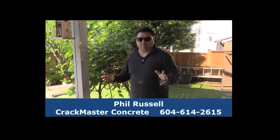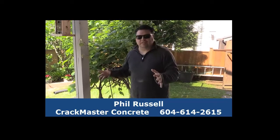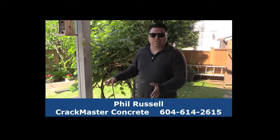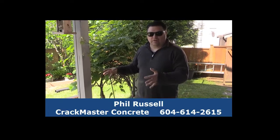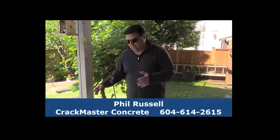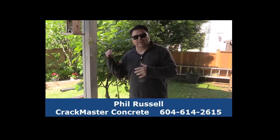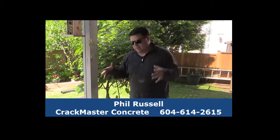That's the problem. And it's an educational process here. A lot of people don't understand that this is the most important, besides your roof, of keeping water out of your house. If this sump fills up with 18 inches of dirt, it can't get out to the city, so everything builds up. So these things, after the house is about 10 years old, should be looked at,